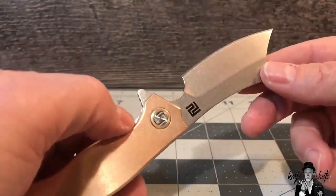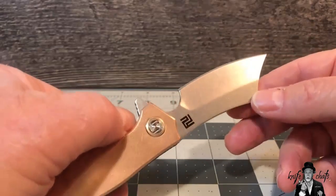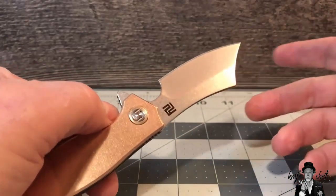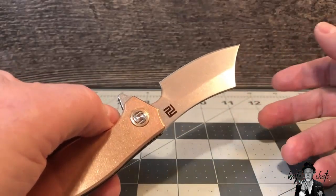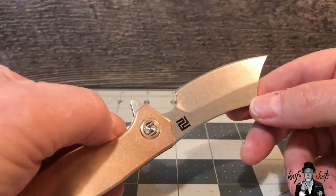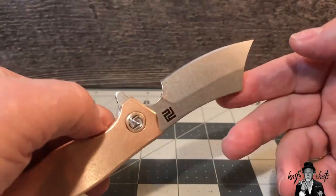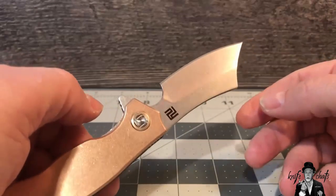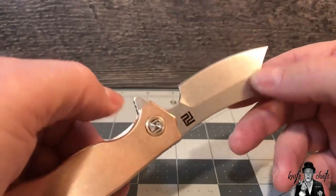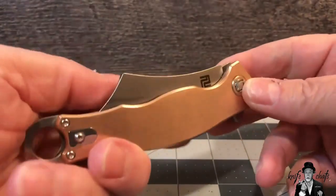The thing about D2 is a lot of people think it's a carbon steel. It's not really a carbon steel, but it's also not a stainless steel — it's actually considered a semi-stainless steel. It has about 11 to 12% chromium in the blade steel, which means it isn't quite high enough to be considered a true stainless steel, which kicks in around 14–15%. But it has a lot more chromium in it than just about any other carbon steel out there. D2 was developed for use in shears — both typical kitchen shears and shears used for sheep herding and that sort of thing. So it is definitely a good quality steel for knife blades.